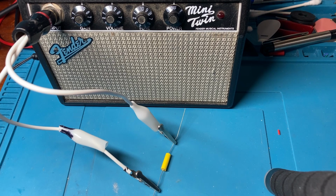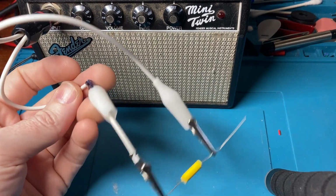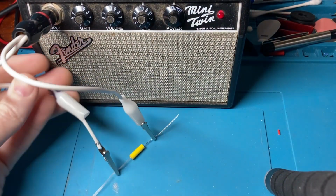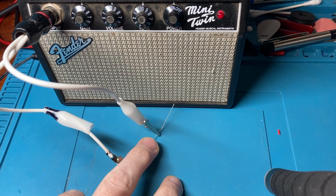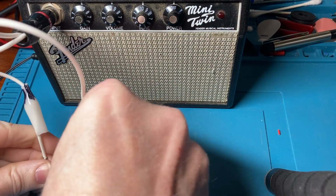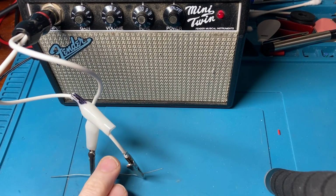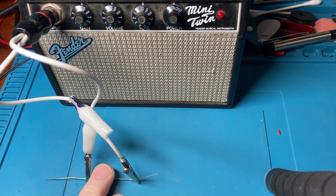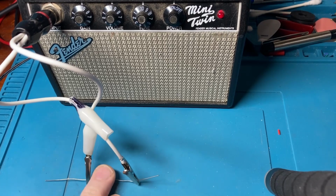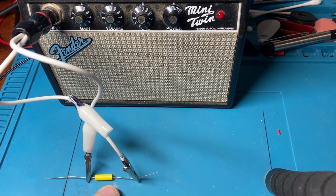To find the outside layer of these poly capacitors, and thus which side is supposed to go to ground most of the time, I simply rigged up this exquisite testing rig where I plug it in across an amp and I touch it. Hear how loud it is? It's because it's acting like an antenna and introducing all kinds of noise into the circuit. So now let's switch it around and see what happens. Still a little noisy, but much quieter, because now the outside layer is acting like shielding, which is why you want that part connected to ground. It's just a little thing that contributes to less noise in a circuit overall, although at higher voltages like in radios and guitar amplifiers, it's absolutely critical.